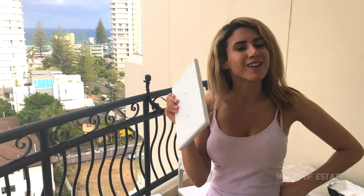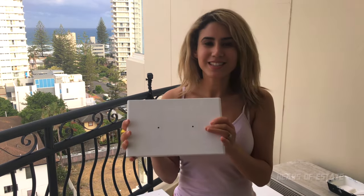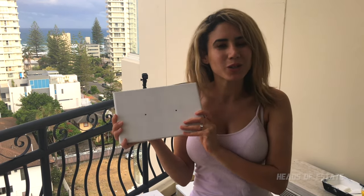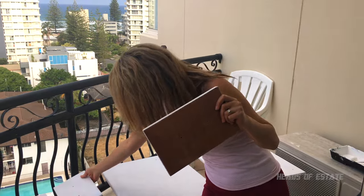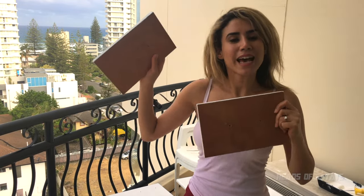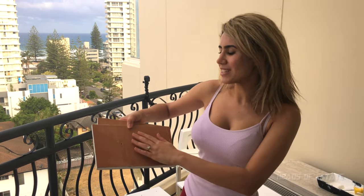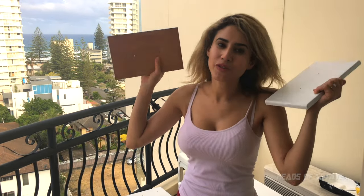Welcome back — it's been well over six hours since I did my second coat of laminate primer. As you can see, that horrible brown color is almost completely gone on one side, though the other side is still the old color. Now it's time to do the other side — we prime the surface, sand it down, wipe it clean, apply the first coat of primer, leave it to touch dry, then apply the second coat. Hey presto, you're ready for your final touches!